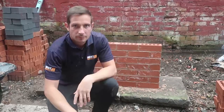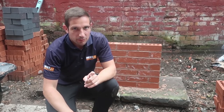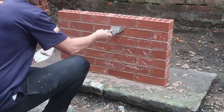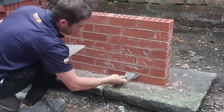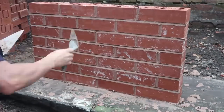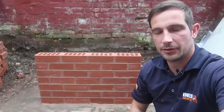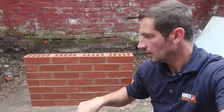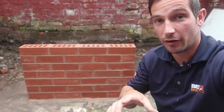I'll reset the camera. Right, I've done the build now — I'm going to joint it up and we'll see what it looks like. We'll get the level out and tape and then we'll score it. It's finished now, I've just cleaned it off with a wet piece of cardboard, no acid or anything. Looking a bit like a mess really, but not too bad.